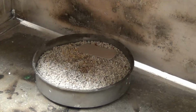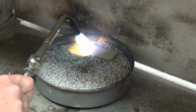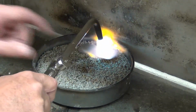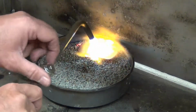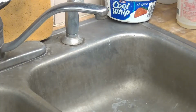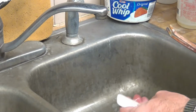Okay, we're at the soldering station for the annealing process. Looking for a nice dull glow red. As the metal gets thinner, it heats up faster. Nope, not there yet. There, nice little glow. That's what we're looking for. And now we have to quench. Now we quench. And then I have to dry it off, make sure it's completely dry before putting it on the steel rollers.